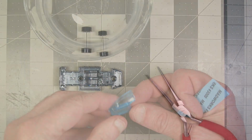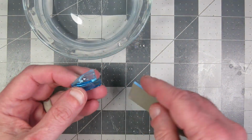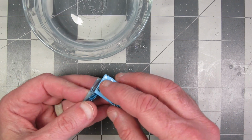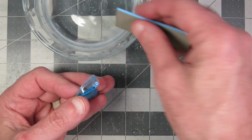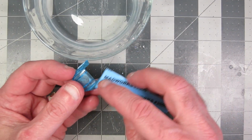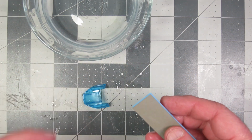So, yeah, at this point, I thought, well, let me clean up the glass. And this is the replacement glass, one from another casting that I had that I mentioned. So it was still a little rough. It just didn't have a crack like the other one. Sanded that up with the 3000 grit, then polished it with Flitz.